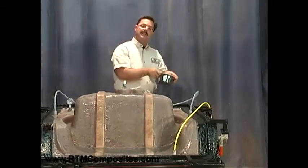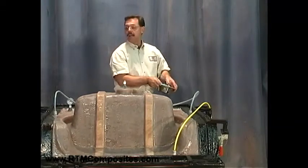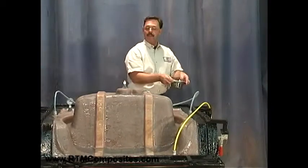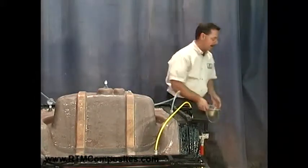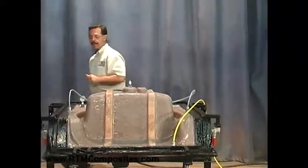I just wanted to be certain that you could see some flowing through the tube in this demonstration. But we could pull probably 600 grams out. We put in 4.9 kilograms — we could set that at 4.3 or 4.35, and we would have fine parts and save this resin here. That would be similar to what happens if running manually, where the operator would just overfill the pot — and that's unnecessary. We can prevent that by running with the proper recipe.